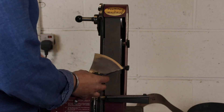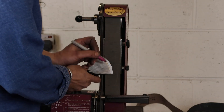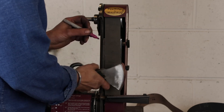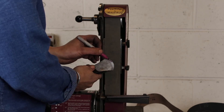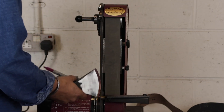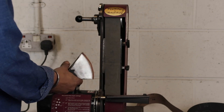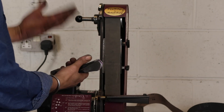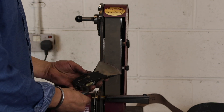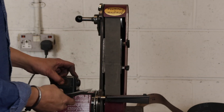I've put on a finer belt — same process, mark it up and run through the scratches. My view of sharpening is that you set the bevels accurately with a coarse belt and then all you really need to do after that is remove scratches — you're not doing any shaping. That was set with the first belt. I've run through it once but I'm not going to make you watch it three times.